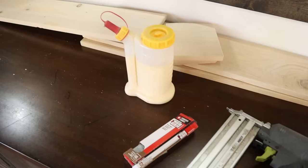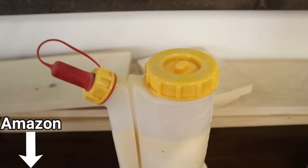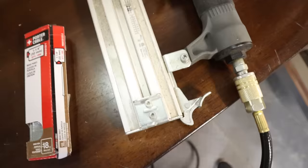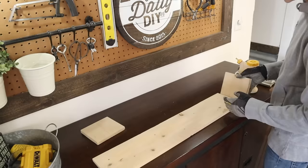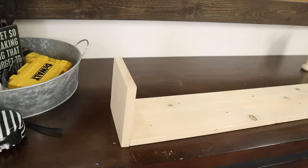To build this flower box, I'm going to be using a combination of wood glue. This is my glue bot. I'll link that down in the description box if you're interested in that. This is also 1¼-inch brad nails I'll be using with my 18-gauge brad nailer. I am attaching the two end pieces to the bottom piece first, so using a little bit of wood glue on those side pieces, butting them up against the ends, and then I added 3 brad nails into each side.